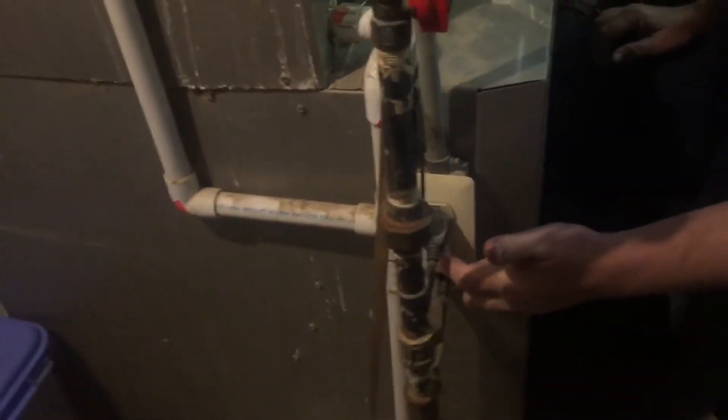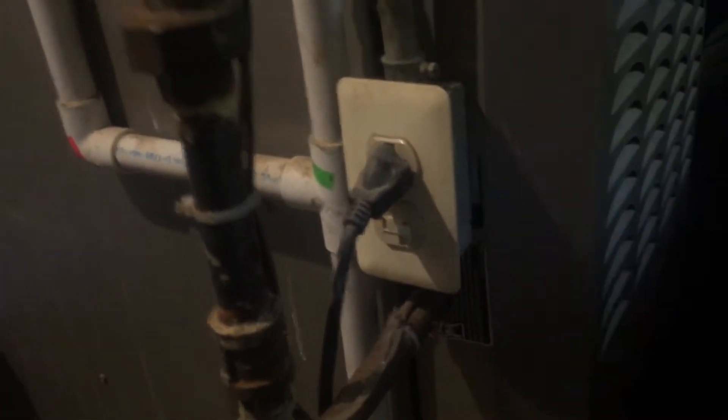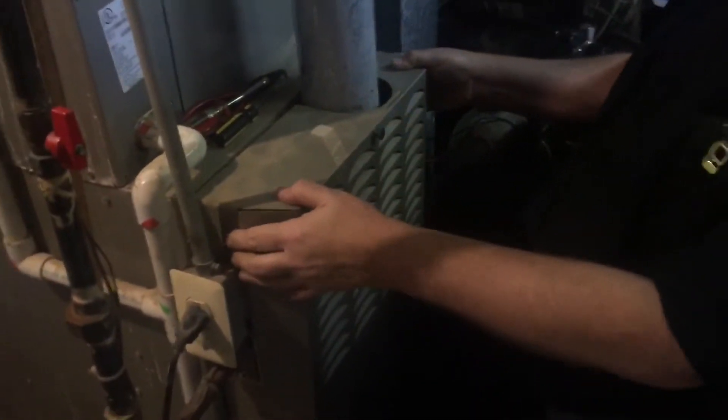Furnace repairs can be really expensive, but most of the time they're pretty easy to fix. First step: turn the power switch off — on this one it's just a little switch here to turn to the off position. Next step, remove the cover plate on the furnace with the thumb screw here. We'll take this out, the whole thing kicks backwards and pulls off. Set that aside because we don't need that again.